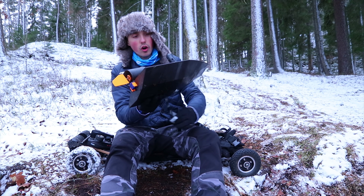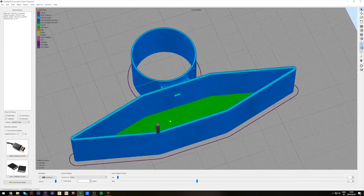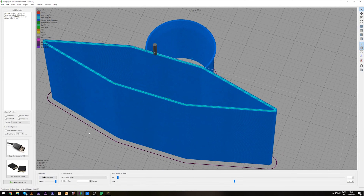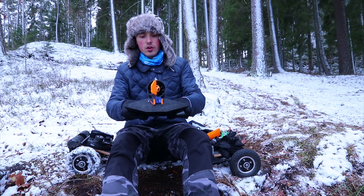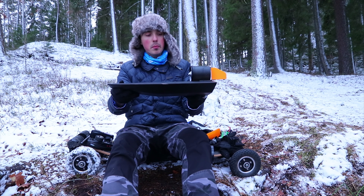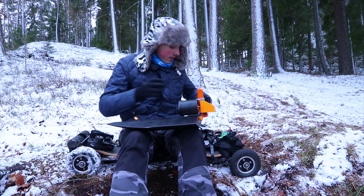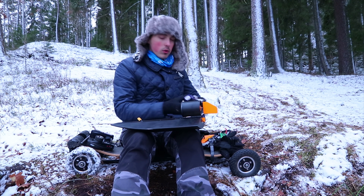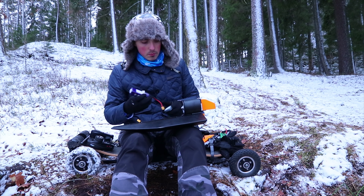The 3D printed parts are 800 grams — just plastic weight. I simply made it too heavy, there are a lot of parameters. It could be that it's just overweight, but the good thing is that it's very very strong — you could probably skid this along pavement and it wouldn't budge. So how to remedy this: I will remove the 360 camera — that's a lot of weight — and I will use the 4-cell batteries to get more power.